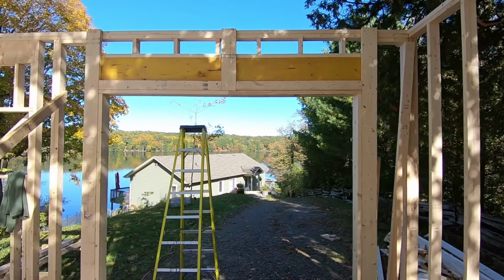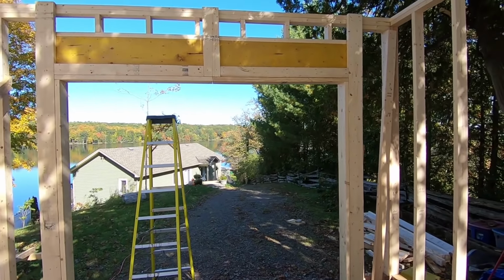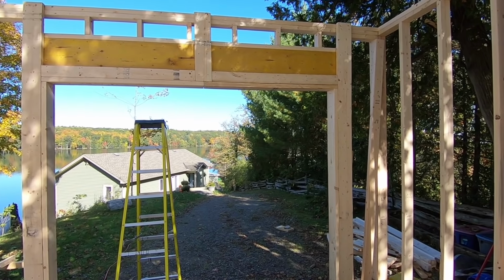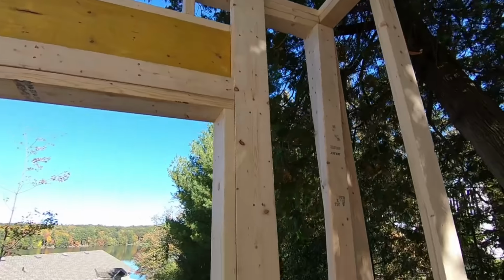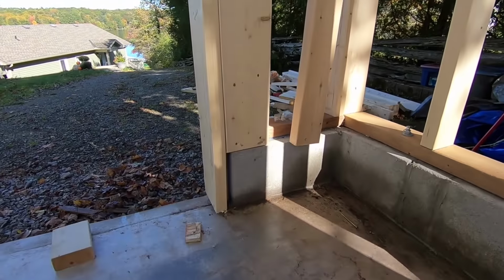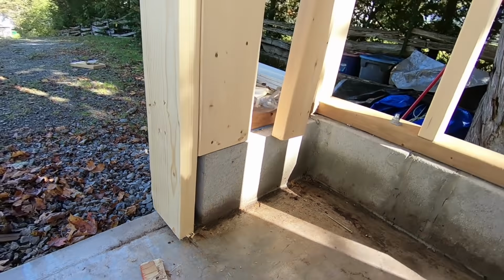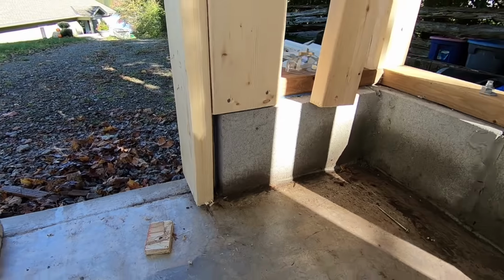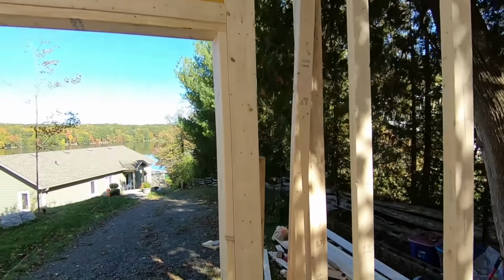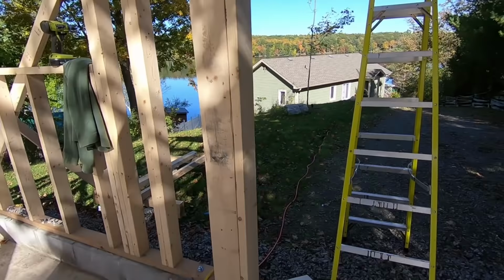All right, so here's the small garage door, all framed up with the rough opening and I think the proper bracing for the garage doors and motors. I know this 2x6 is supposed to come all the way to the ground, but if I did that, I had to pretty much double it up all the way around, but the garage door guy says he can work with that concrete block at the bottom. He'll just Tapcon in the bottom brace. That's that.